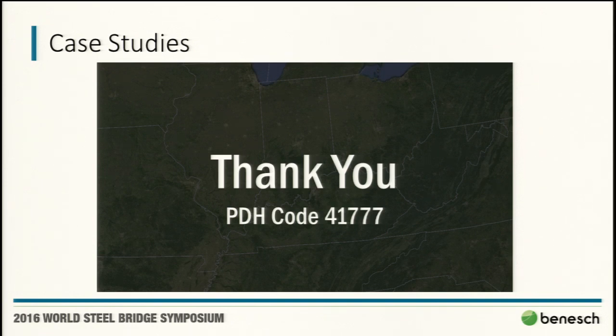What's not shown here, and from a design perspective, I'm not sure why they did it. Tennessee DOT is a good client of our Nashville office, so I won't speak ill of them. But there were minor curves at the end of each of these bridges, which really kind of created a challenge. And the overall length of the continuous unit was 2,100 feet. I feel like there probably would have been a launching alternate there. That probably would have been the next place we would have gone.